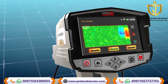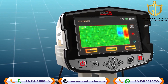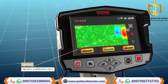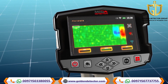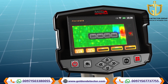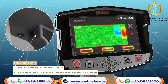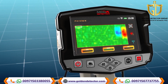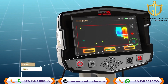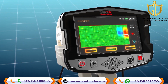Grid lines: This option shows or hides the grid lines representing the scanning area, where each cell represents one scanning step. Scan point — choose a cell from the grid: use this option to select a specific cell from the scanning area grid within the scanning results screen. After clicking the search icon, use the arrow buttons to select a specific cell. Press the back button to return to the scanning tools. Note: the user can press the start button on each cell to display the exact result value for each of the MGS-60 built-in sensors. Color filter: use this option to hide or show the green color representing normal ground, which is useful for highlighting areas that include metal targets or voids.